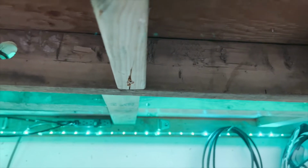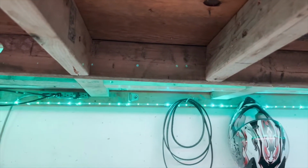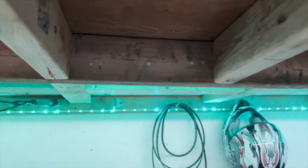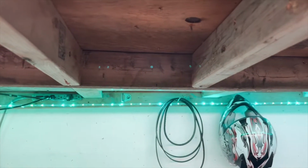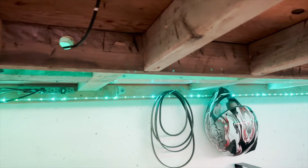You want it hard on one end, but you want to allow it to have a little bit of upward and downward axis, because it's going to prevent any other slippage, and it's going to be the moving point or the designed flexing point of your pulley system. So when you mount your tensioner arm, oh, hold on, let's get back to the story here.